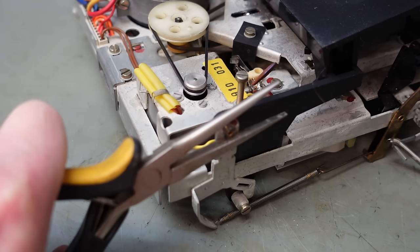Well, that's the take-up motor, and it's connected to a plug that goes into this loom here. And the cables all seem to come out this way. Well, I can't see any 6R2 anywhere. But I found this diagram shows all the PCBs. There's actually 8 circuit boards in here. That's quite incredible. Presumably 6R2 is resistor number 2 on PCB number 6. Which is on the back of here. Hiding. And there's R2. I'm just going to short out this crocodile clip lead.